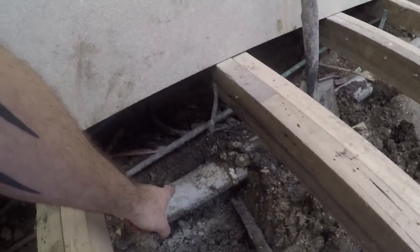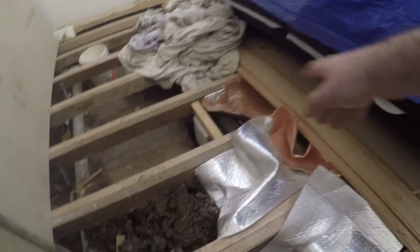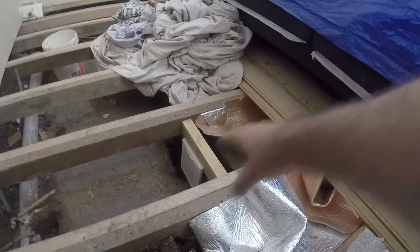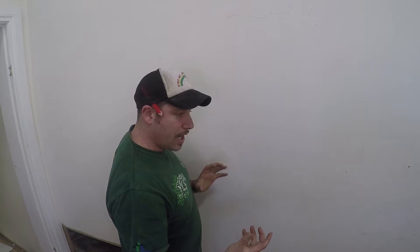Step over here and have a look. We've checked our pipes — I've just dug this out so you could see. This is an old sewerage pipe but there's a little bit of moisture around that pipe. Water is a bit lazy in that wherever it's soft it'll run, but it's also a big pain because wherever there's a small weak point, it will follow. You can see the underfloor insulation throughout, and one of the ends of our venting ducts comes in here to dry out this area. Soil being soil, what happens is it then contracts — so cracks and things happen and things can move.